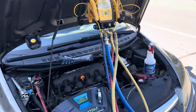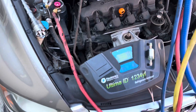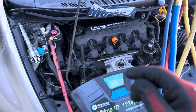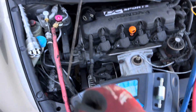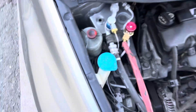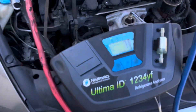2007 Honda Civic — the technician owns this car and purchased it recently. The AC doesn't cool well when it's hot but cools well when it's cold. I noticed UV dye in the cap when I opened it — you can see that bright spot right there. I asked her and she confirmed the previous owner had put in refrigerant and dye, and now it's not working.